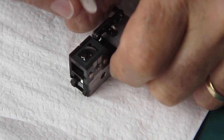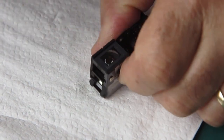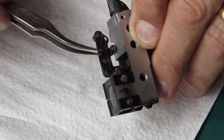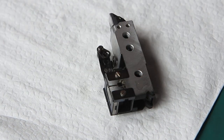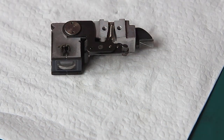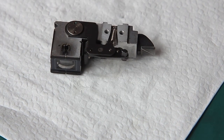I think that's moved it too much now — it's low. Let's tighten the front screw up. There's obviously a bit of play there — now that's correct. My vertical alignment is correct; my horizontal alignment is not. Looking at this as the rangefinder returns to the infinity position, I can see it's coming back further. Remember we dissolved the lacquer that was holding the front lens assembly in position — that holds the whole front lens assembly and stops it shifting. If you shift this lens one way or the other you will shift the horizontal alignment. I'll press that lightly across and see if my horizontal alignment has improved — it's slightly worse. Let's push it back the other way — that's improved. That's virtually bang on.